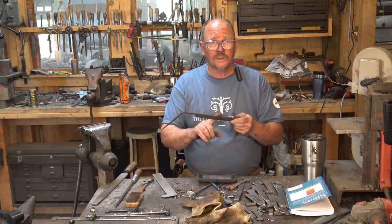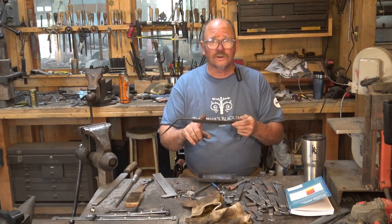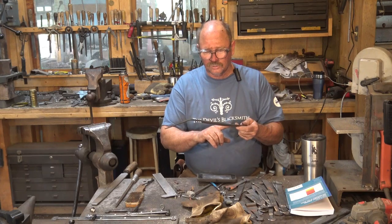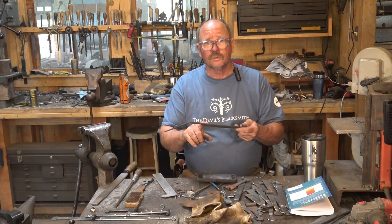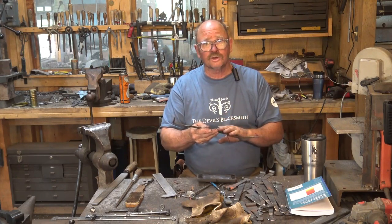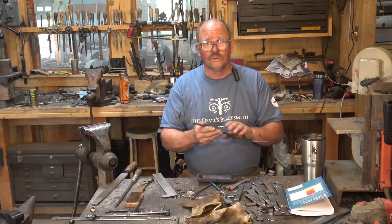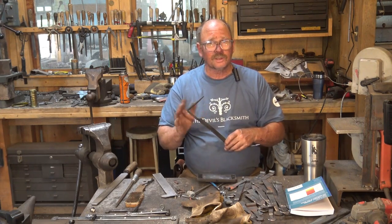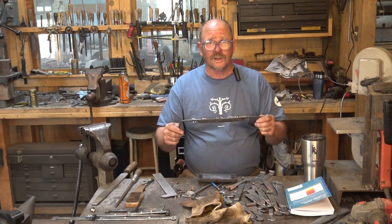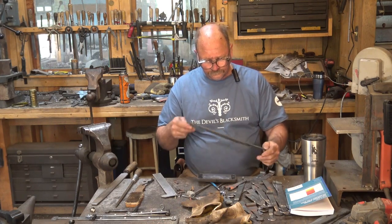Well, like I say, I'm going to go ahead and give this a nice even temper, and then we're going to try and straighten it. And I'll do that as part of the next video. After that, we will polish this up as much as it needs to be polished. It doesn't have to be a complete mirror polish, although the better a polish job you do, the finer an edge it will hold. But whoever is the final owner might have to polish that up some. And that's not uncommon in old tools, that it was the new owner that had to do the final finishing on it. The blacksmith just got it close.